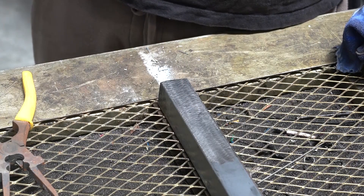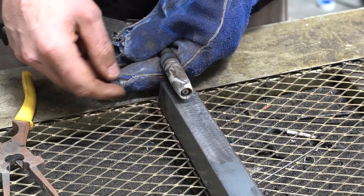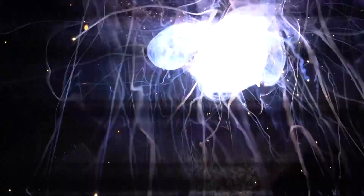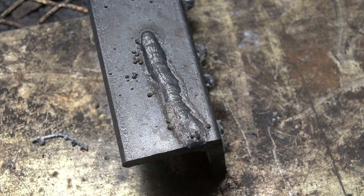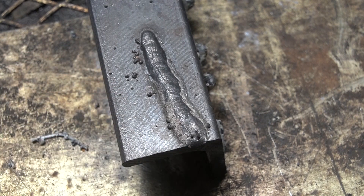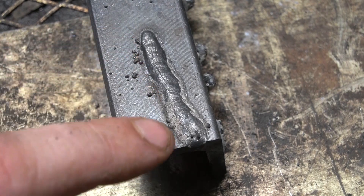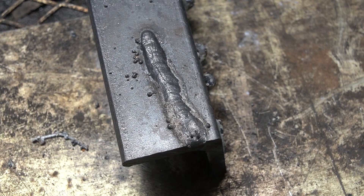The last bit is what you get with a little dialing in. I don't want to show what happens when wire speed is too low, because it tends to block up the nozzles — the molten metal goes back inside and you have to strip the whole gun down to clear it. Unfortunately this is the best I can do for now; the welder is about seven years old and heavily used, probably more than it was designed to be. The wire is coming out sporadically, resulting in lumps. But the amperage seems to give okay penetration, and if you're using one of these in better condition you'll have much better results.